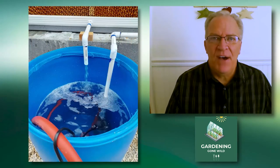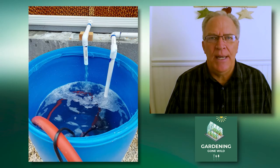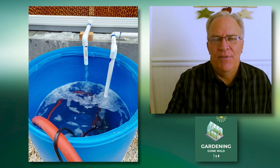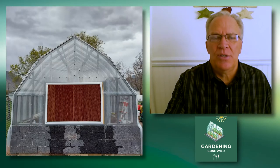My sump is a 55-gallon drum — the blue handle controls the flow down to where I need it, and then I have an outlet that lets the water back down into the sump. Notice I've got a couple of little leaks at the bottom of my cooling pad — I feel like I need to eventually redo that bottom trough, make it a little taller. Right now it's four inches and I'd like to get it about six inches to help contain all that water so it's not always bleeding onto my block. You can see how the inflation fan has pumped air in between the two layers and made the poly round.